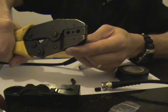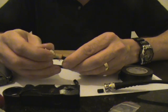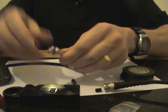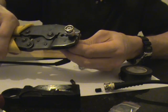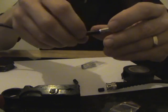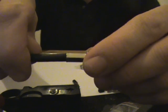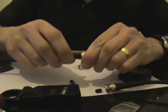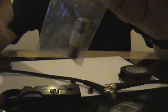Simply crimping the connectors on like so. Push it on carefully — you should feel a little click again. We will crimp that on there. When we are crimping, the crimping tool is giving it a hexagon shape around the collar. Push the stress relief boot on there again.